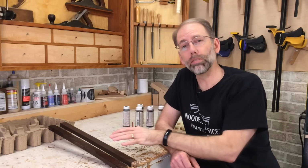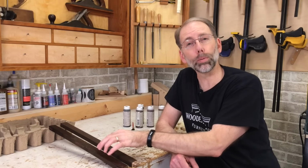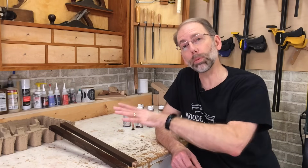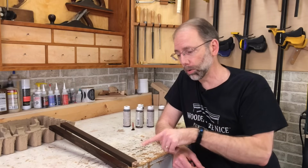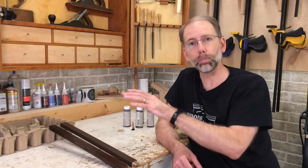The stain is now dried for about an hour, and I put some stain over top of the finish on this piece I repaired, and I need to wash that off so the lacquer will adhere properly. Once I put the lacquer on these, we can compare the two and see how they turned out. I also need to drill pilot holes in this piece so I can put the screws through, I'll get that done first and then move on to the lacquer.